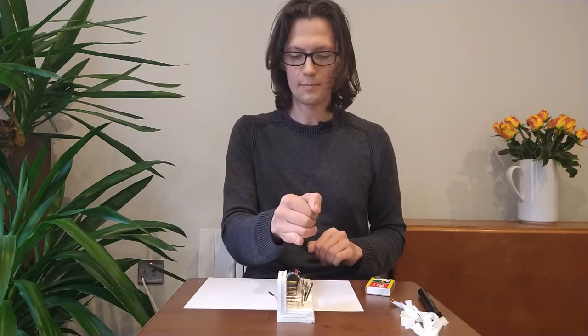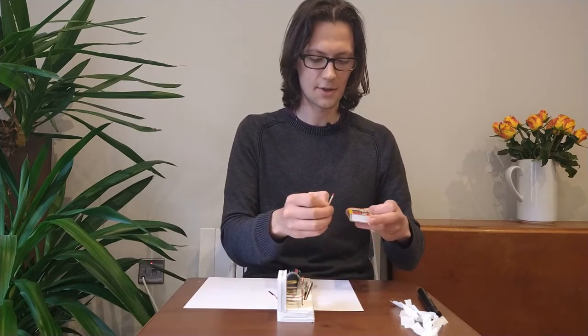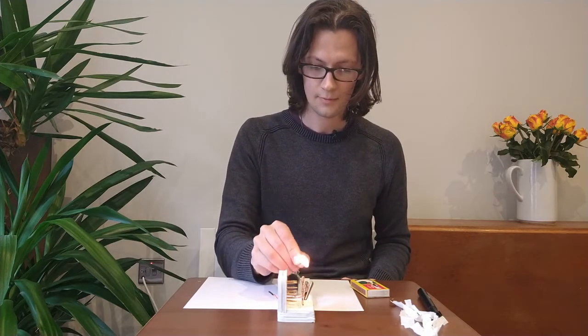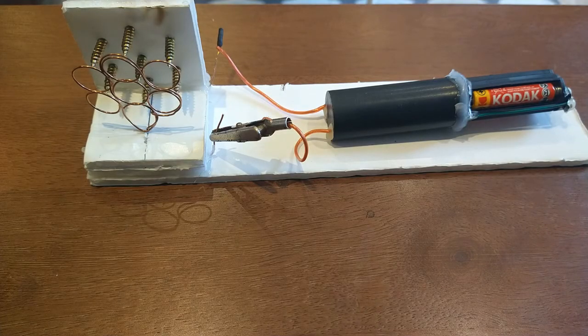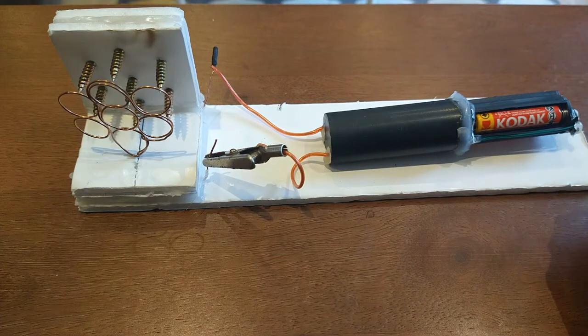I'll try that again by actually placing the match between the electrodes — I wouldn't recommend this, but it does look pretty cool. What you should see is the stretching out of the flame as it's attracted to the electrodes across the electric field between them. We've just stopped there having scorched the foam board slightly. But that's a couple of fun demonstrations of the fact that there is this ionic wind there, and also a very strong electric field. I can also hear a kind of whistling when it's switched on, and I can smell something — it smells like ozone to me. Where the gas is being ionized you're probably getting ozone and maybe a few exotic nitrogen oxides being formed.